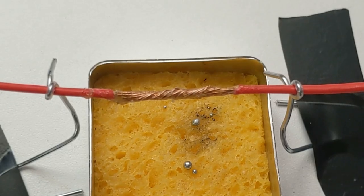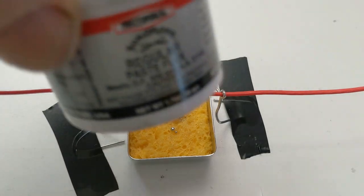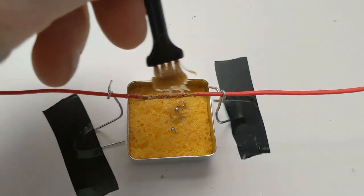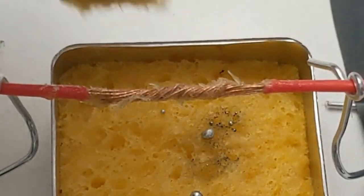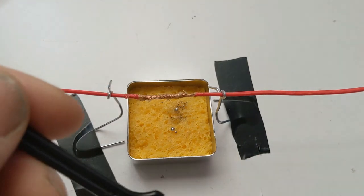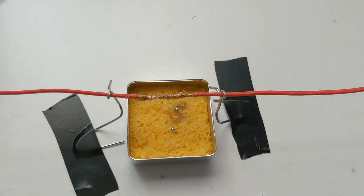We've got our wire all set up here. I went ahead and took some flux paste and put it on the wire — it's just going to help the solder pull into the wires much better. Always a good idea to use some extra of that. We're going to go ahead and tin the tip of the iron. I usually like to put a little bit of the flux on the tip as well, and then we're going to get this thing heated up.